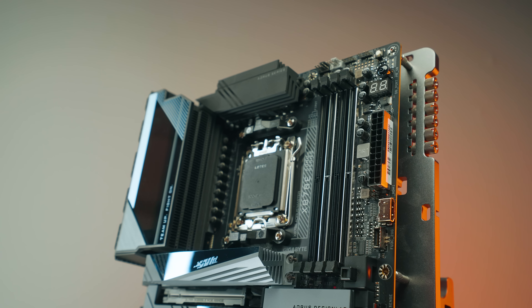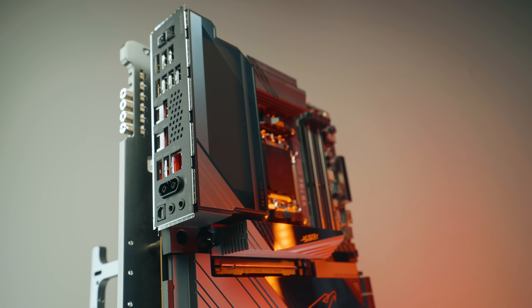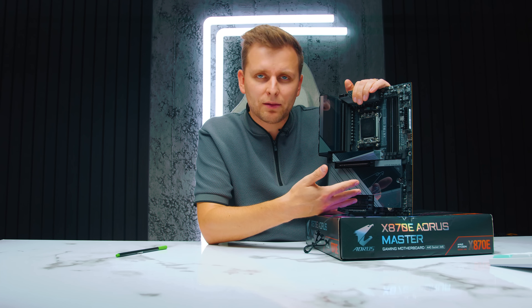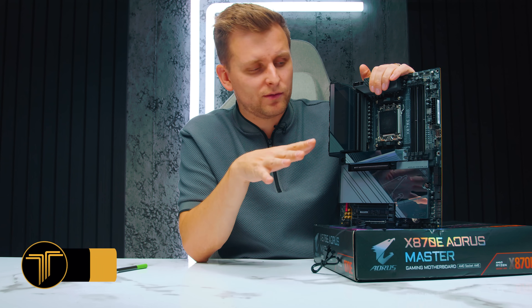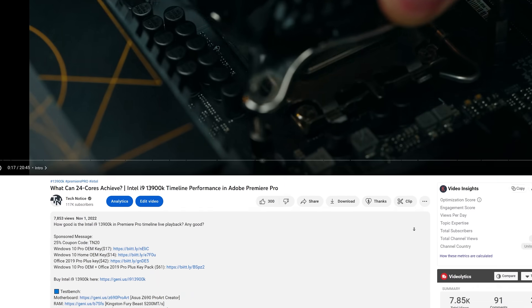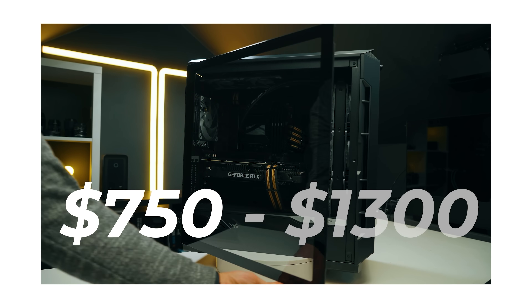All in all, this is a fantastic motherboard at that price point. I do have some nitpicking concerns. As a reviewer, I don't like to see undisclosed PCIe lane switching like that. Don't tell me these are all Gen 5 parts if I'm losing some of the other bits — just tell me one slot is Gen 5 and the rest are Gen 4, or find some other way to handle the PCIe lane switching. I want to know that when I'm plugging stuff into my motherboard I'm not going to lose anything, especially at $500. If you're interested in a PC build, check out the links in the video description below — there's a PC build for every budget. Thanks for watching, bye bye.